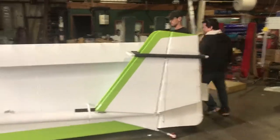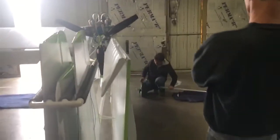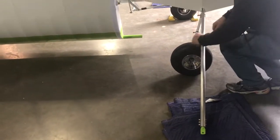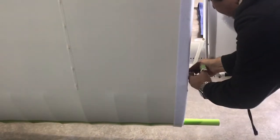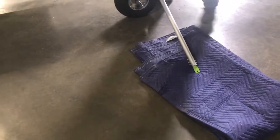We're going to walk around to the other side of the airplane and they're going to repeat the process just exactly the way we did it over here. Duane's going to unpin the forward attach point after attaching his lift strut into position. You'll notice he's setting his lift strut on a cloth to keep from banging things up — we like everything to look brand new when it's done. He's going to unhook the forward attach point just like that, and again that pin belongs right in the outside of the lift strut. Then Dennis is going to bring the wing around.